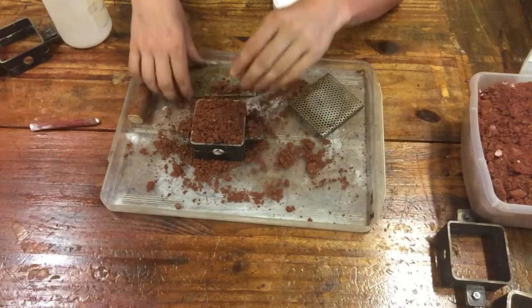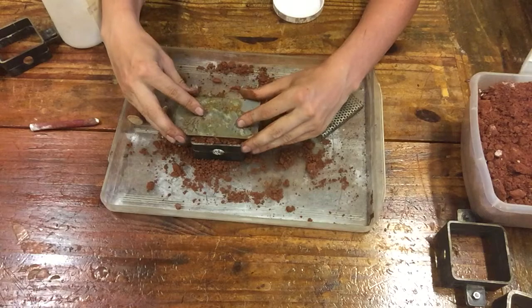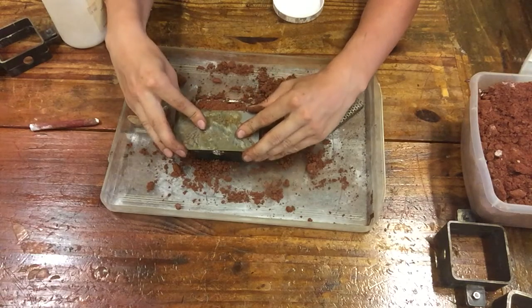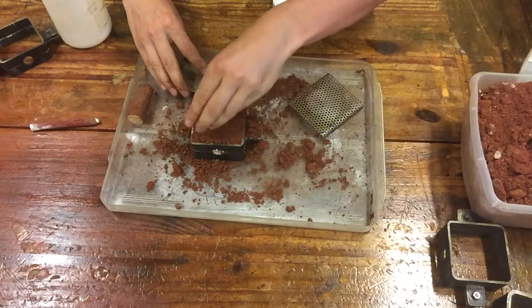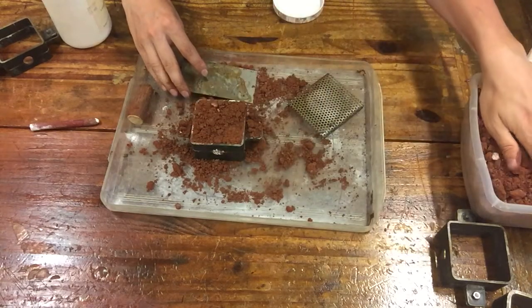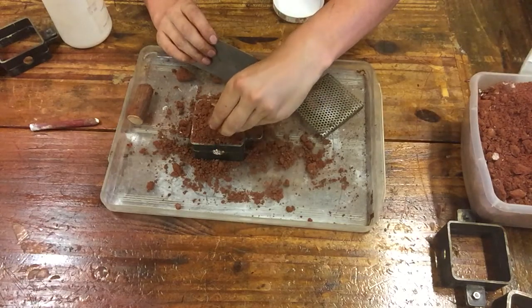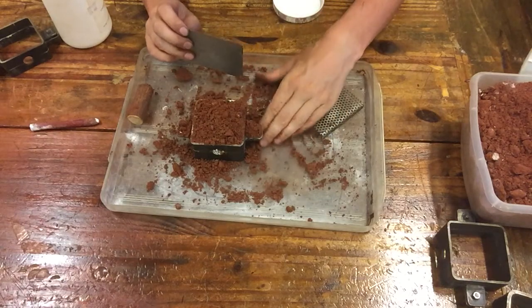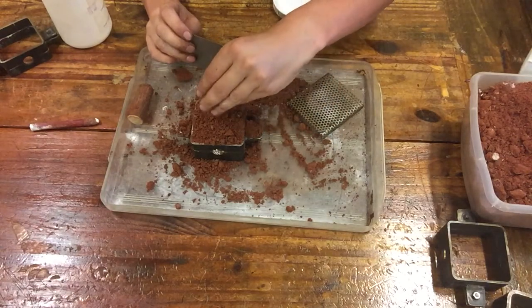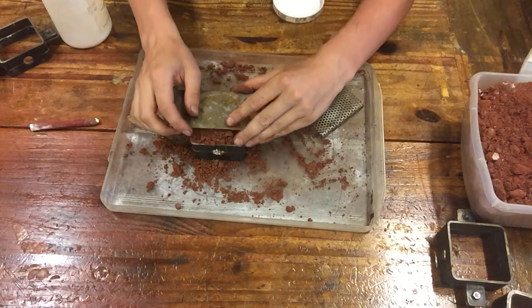So at this point, what I'll do is I'll take my scraping sheet and I'll just gently compress down. And then I'll add some more sand. And you don't want to push so hard that you feel your sheet metal bending, just enough to know you're getting a nice soft pack. And what that does is that packs the sand around your master part to establish the details that you want to keep, okay? So we're just going to push that down,